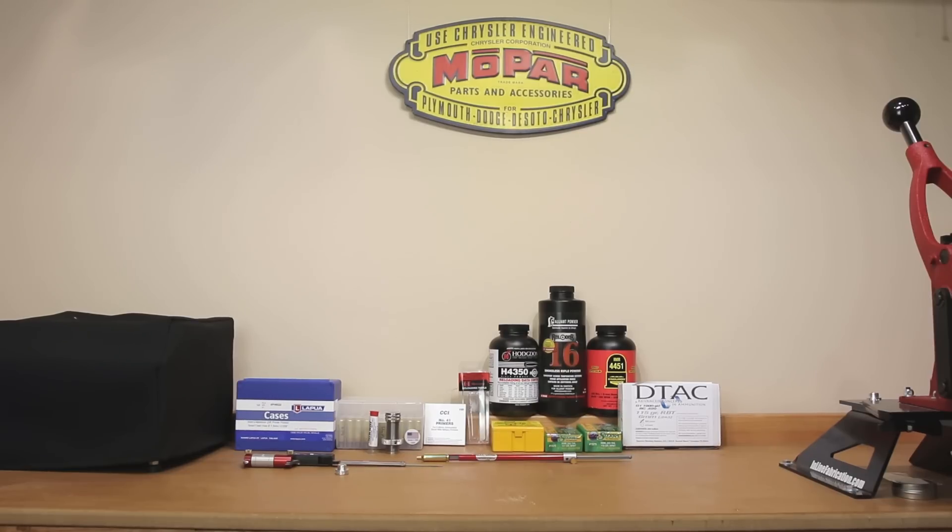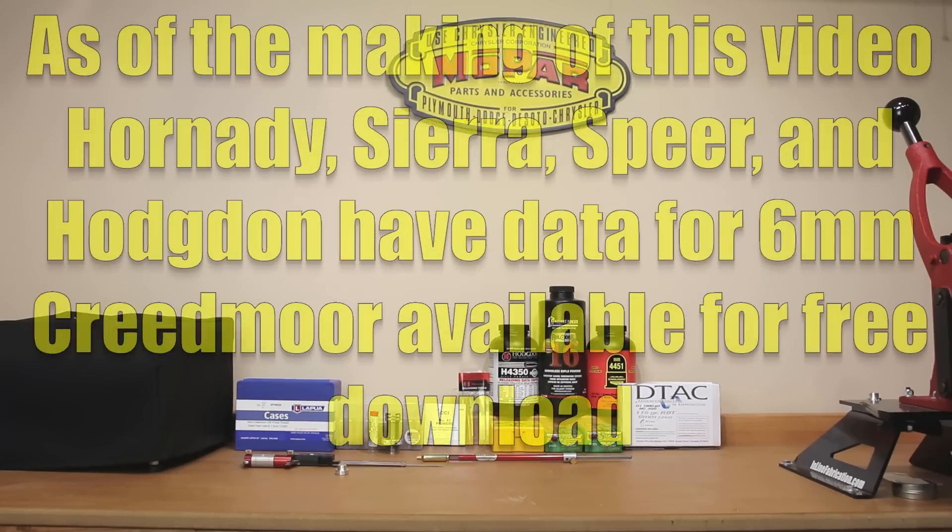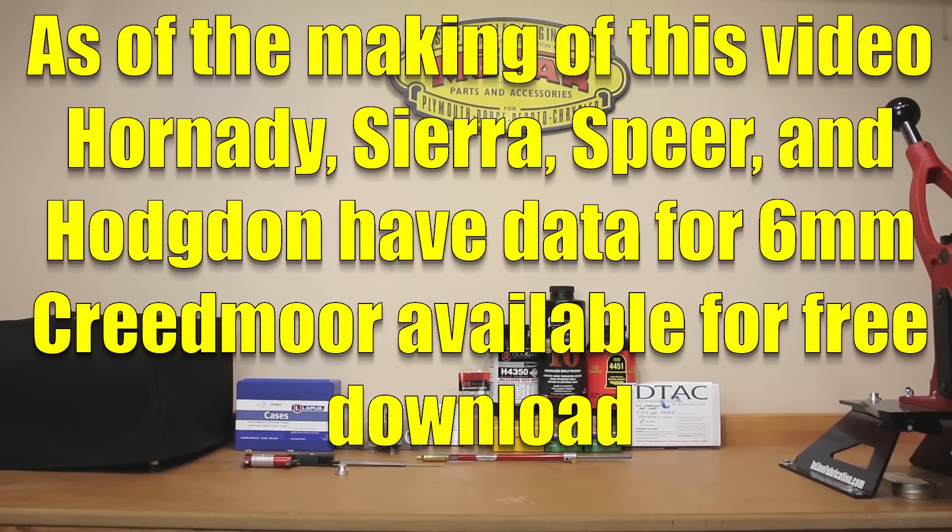One other thing is making sure our brass is the right length. I might do a video comparing brass specifically from Lapua and Peterson — both brands I've found to be excellent brass. When I did all the actual length measurements, both brands were very close to the 1.910 inch trim length, so no further brass prep other than making sure the neck diameter is set correctly will be required. One of the things we also need to talk about is load data, because you're going to find the trim length in the load data.